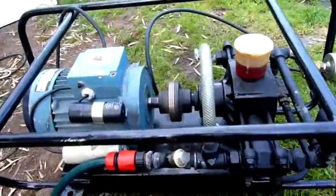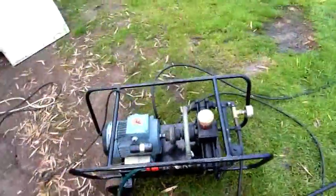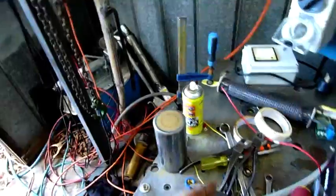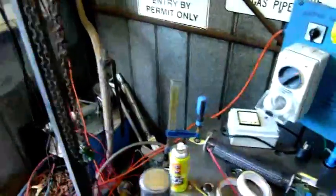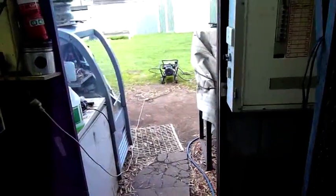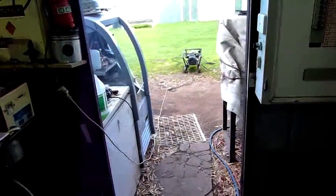If I play with the unloader, it'll either just sit there spraying at low pressure, or it'll start surging up to about 1200 psi and then back down again — just thunk, thunk, thunk. I just can't get it to settle down. There's an online DIY suggestion about getting rid of minor water leaks which could pull air in, but I'm feeding it 100 psi of mains water pressure — stuffing more water into it than it could ever use. And it's still doing the same thing even though I've sealed up every possible leak. So there's no air getting into the system.